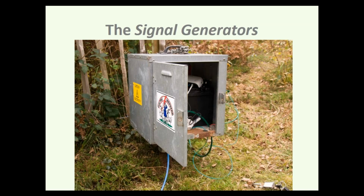The Common Sense Fencing utilises dog fence equipment. It uses a coded FM signal, and there's 4 transmitters available for that, so you can do different lengths. That system can go down to 20 meters and up to 6,500 meters, which is their newest one, which is available, but I think is more experimental at that length. The Common Sense Fencing requires 24 volts, so you'll need 2 batteries in line, and the battery will last for about 7 days. The large transmitter they have, which is for the 6,500 meters, requires 36 volts, so that would require 3 12-volt batteries.